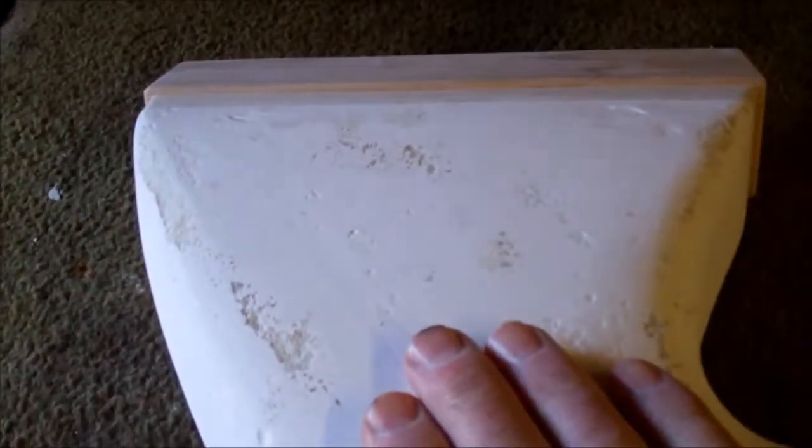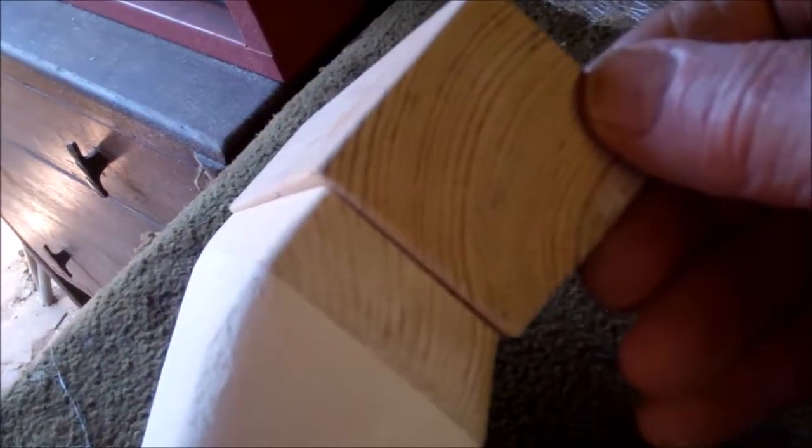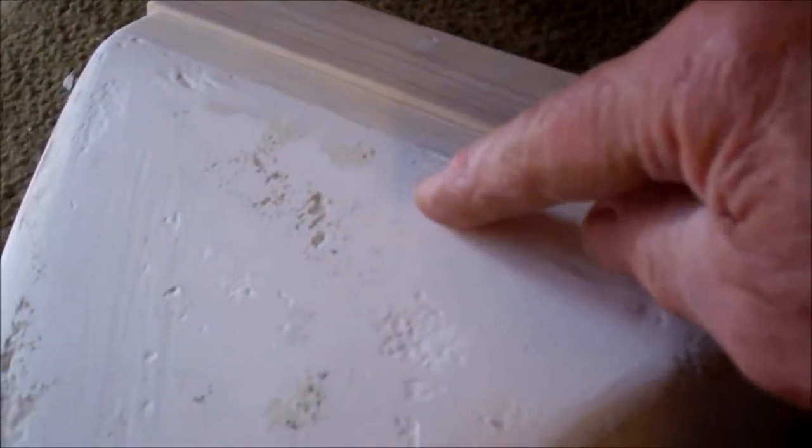I made a wooden box, filled that with polyurethane expanding foam, filled it up like that, and carved the polyurethane into this shape. I glued a piece of wood on the end, made that piece in the lathe, glued that piece on to grip it in the lathe, and made the top out of wood that's glued on as well.